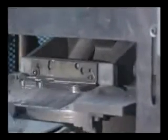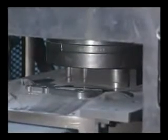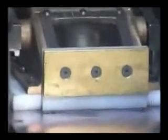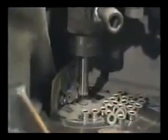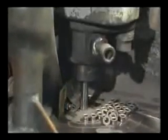In mechanical pressing, the powder is automatically gravity-fed into the die of a mechanical or hydraulic press and consolidated to a specific density. Pressures of 10 to 60 tons per square inch are created by the vertical action of an upper punch or by the double action of an upper and lower punch. Pressing is typically at room temperature, although elevated temperatures can also be used. Core rods are used inside the die to control formation of holes parallel to the direction of pressing.